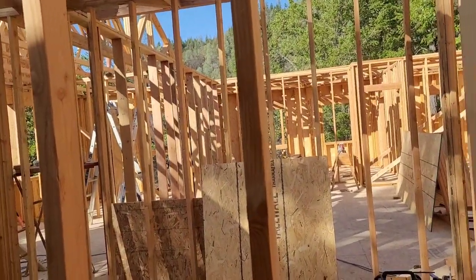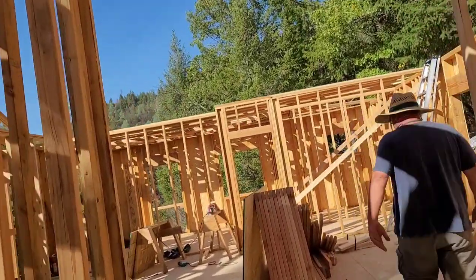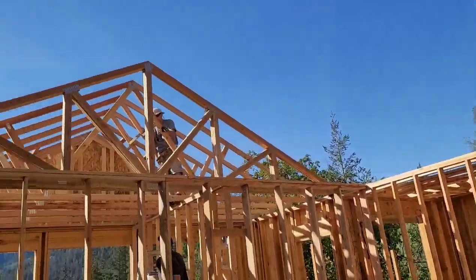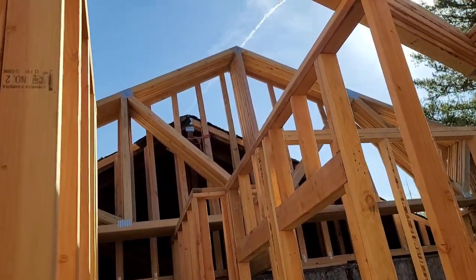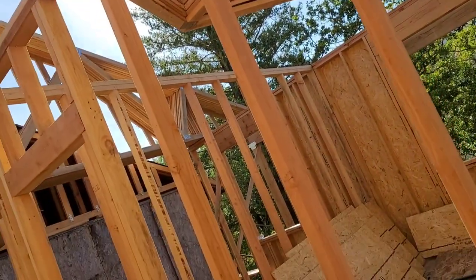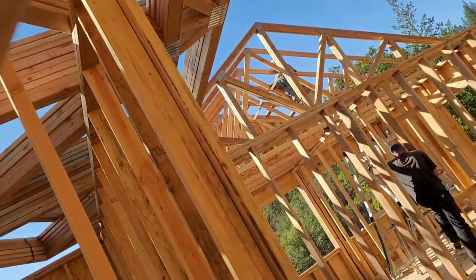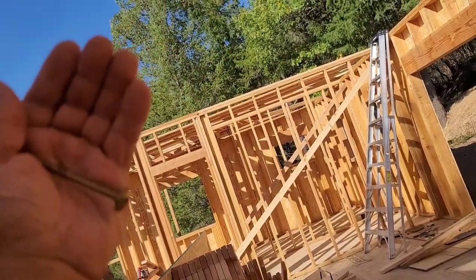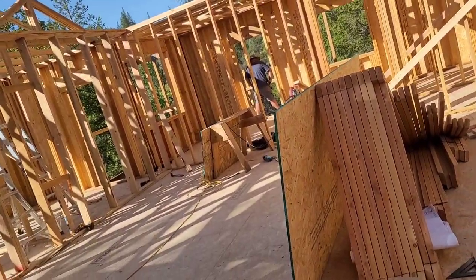So we're all happy because this was a quantum move. And the next step is to finish the roof here in this big living room. And the trusses coming from the garage are right there, up there on the top. You see them in a bundle. And we'll walk them out over to here, tying in with these other trusses, and go back, and we'll do the same thing on the other end. We'll work from this wall and go back. And we'll have it all done.